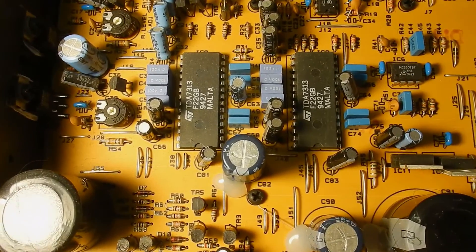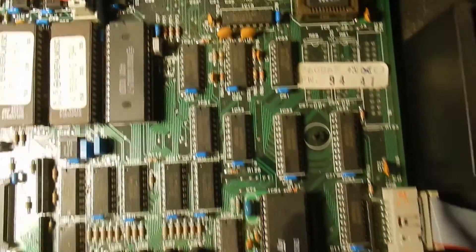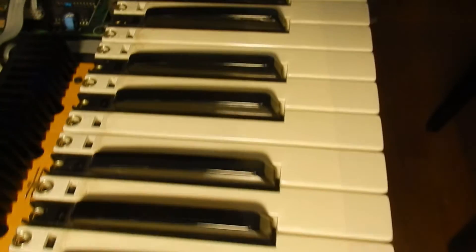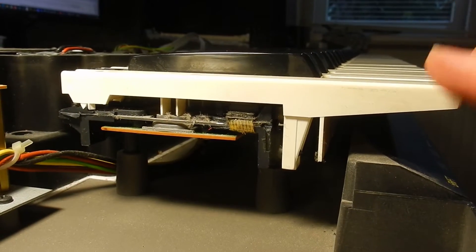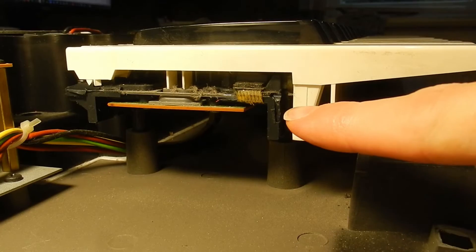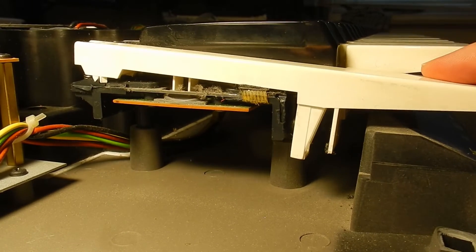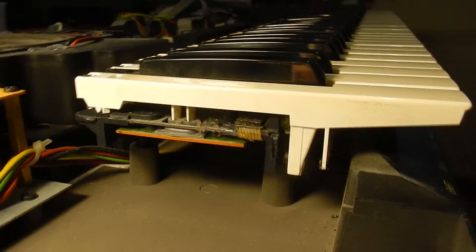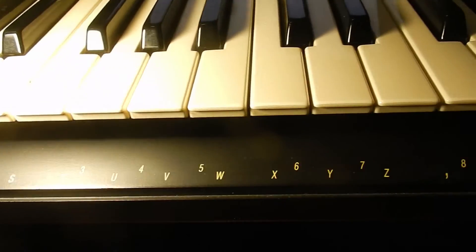Moving back to the analog board, we can see the TDA chips and the DACs in a bit more detail, as well as all the audio input and output jacks. Now let's take a look at the keyboard mechanism. It's pretty good — very good feel and response. This key mechanism is velocity sensitive and has aftertouch. Each key contains two rubber dome contact points, similar to a TV remote or game controller. The aftertouch contact point is mounted a bit higher and further from the hinge point; you have to press down quite a bit when the key is bottomed out to activate it. All key switches are connected to one long flex cable, and the I/O is handled by a Zilog Z8 microcontroller — the key scanner's CPU. I find this keybed to be of higher quality compared to my EMU X-Board 49. It's very silent in operation, whereas the EMU X-Board has a cheaper, noisier, and more plasticky feel.